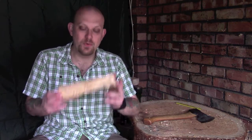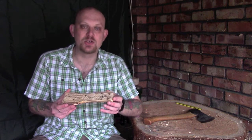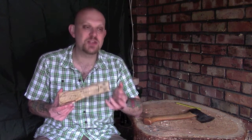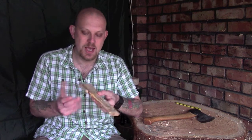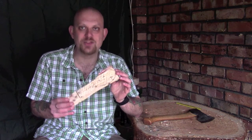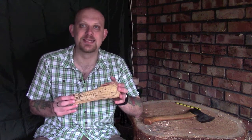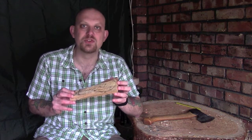I hope that was useful. That's just my method for making sure I can use my axe to remove a lot of material very quickly. Obviously if I'd done that with a knife it would have taken much longer, although you can have more control with a knife. But if you do want to use your axe, especially if you're practising your carving skills, this will allow you to get really close to your marked-on template without accidentally splitting off part of the bowl — which basically means your bowl ends up smaller than you intended, and if you're working to a design you don't want to be removing too much material.